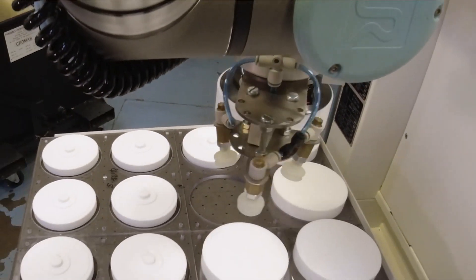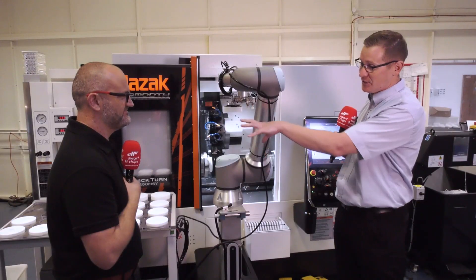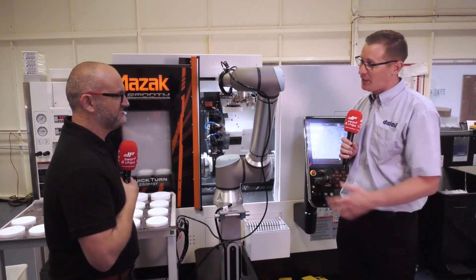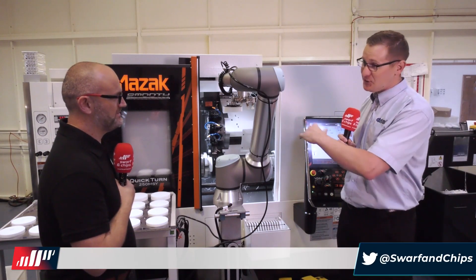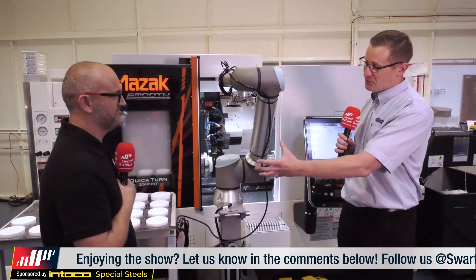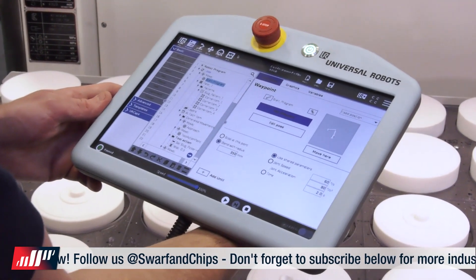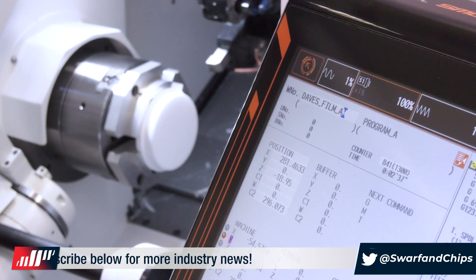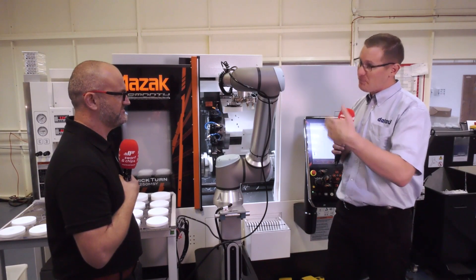You've made that sound really easy, but there are some engineering challenges. Absolutely — the expansion of PTFE and the polymers we use is a challenge because we have to right-size the holders on the bench. And none more so than how the lathe and the robot interact and talk to one another. For the engineers listening, that side of it was actually very simple — we have full robot interface on this Mazak and we only use an M-code handshake between robot and machine. In terms of the pendant, it's more teaching than programming. If you're familiar with an iPad, it's very simple. You can drive through the tablet, steer the robot around, or manually move it, spin it, put it into position and set waypoints which build a full complete robot program.